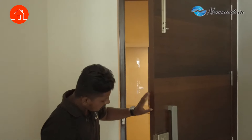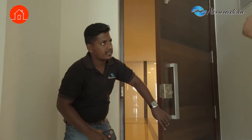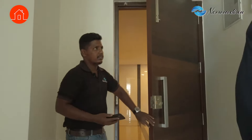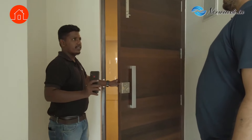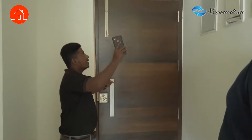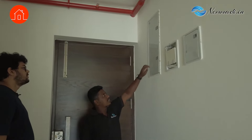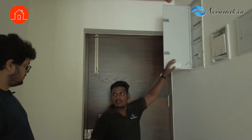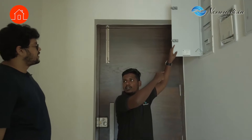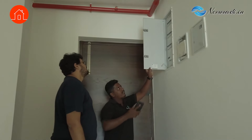These things we will check. There should be a circuit diagram placed here so you can easily trace which MCB belongs to which room, and easily switch off that MCB when maintenance is going on without turning off the entire flat. Here it is missing, so I will take it in the report. So what will you be doing next, Venkatesh? I will check the undulations of the box — I have a torch and by that we can check. You can see there are some undulations.